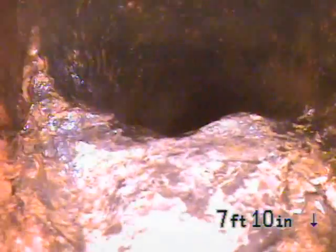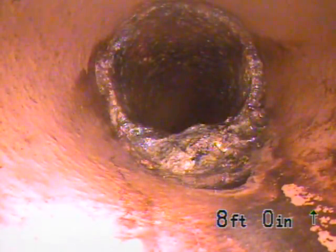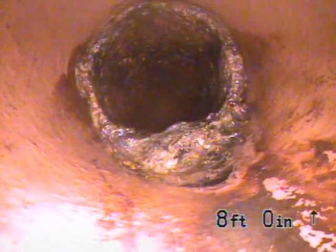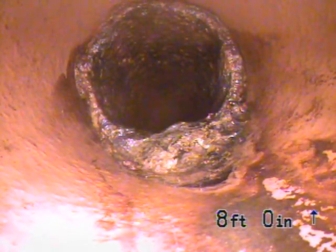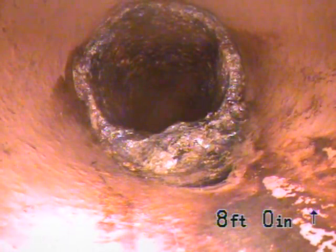This right here is not scale — this is concrete where they joined the four inch cast iron to the almost four and a half inch clay pipe. They used concrete, and that little bump right there will not come off.